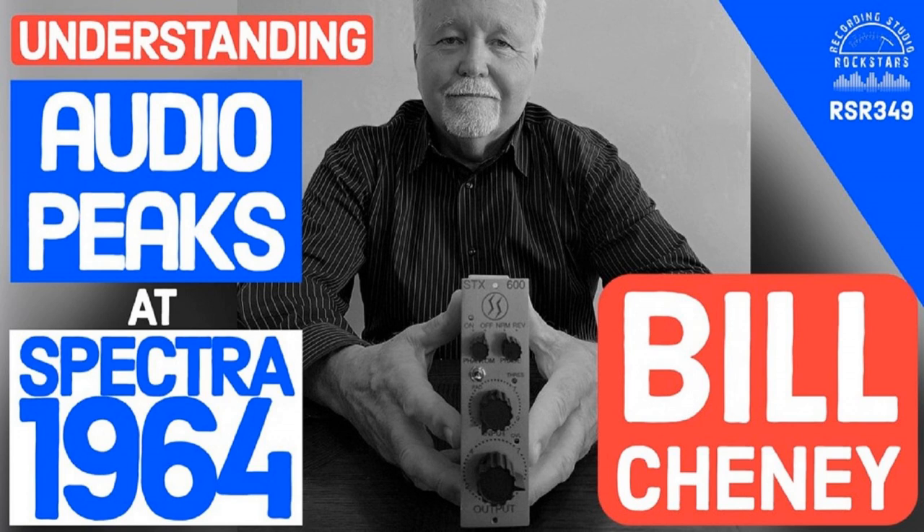Drummers tell Bill they don't have to boost 3 to 4 kHz on their mic pres anymore. That tells him conventional amplifiers are falling off — the harmonics are falling off — and they're having to artificially boost them with an equalizer. A snare is one of Spectra's demos with the C610: put a 57 directly into a C610, go right to your DAW, and play it back. You can go 6 to 10 dB hotter than you normally would, and when you play it back you can hear the attack and the harmonics. They haven't created anything — they just preserved what came in on the input.